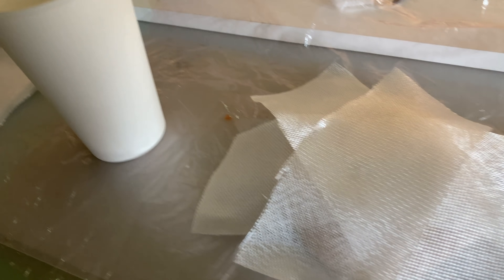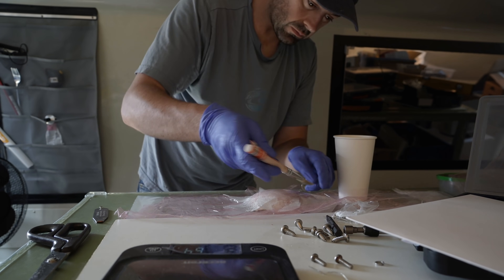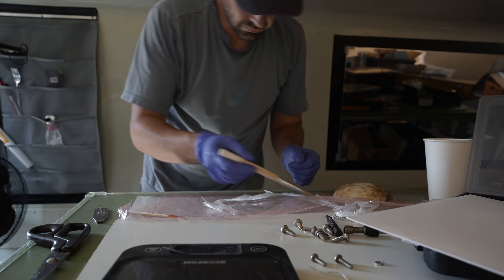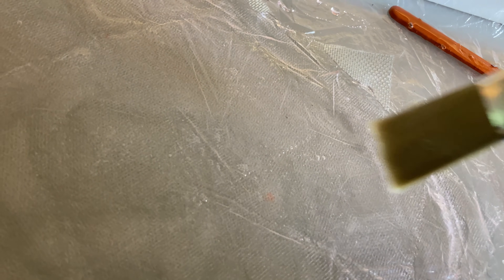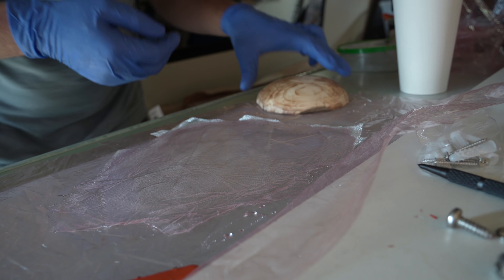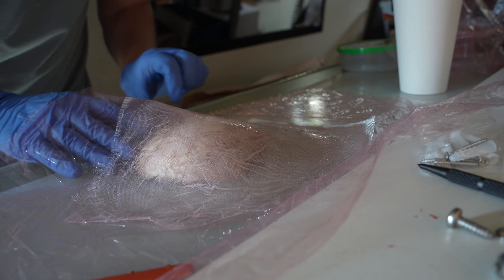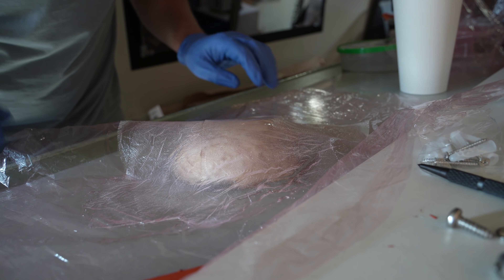My technique was to first lay on one covering of glass strips to completely cover the pattern sat under the release film, giving me the size needed. I'm varying the orientations of strips by 45 degrees so that there's uniform strength in all directions. Then I built up layer after layer of glass, ensuring it was all wetted out, and trying to minimize air bubbles. I stippled out any little remaining pockets of air and excess resin with the brush. For a large part, or if using an opaque fiber like carbon or Kevlar that would render bubbles hard to see, I would have used a fin roller. Next came the fiddly part, as the wet layers of glass could slip and slide if I wasn't careful. I needed to make sure that the glass conformed to the shape without ridging, and that's down to the strip widths and also the fabric weave type. I was on the edge of acceptability, so we'll learn for the next few parts.